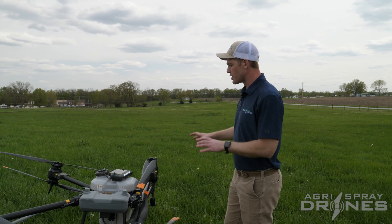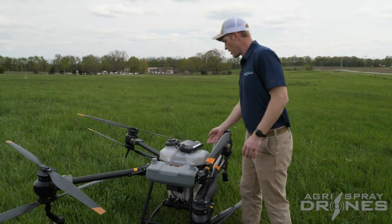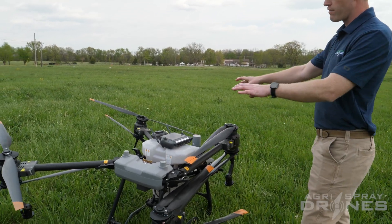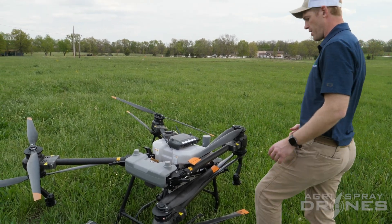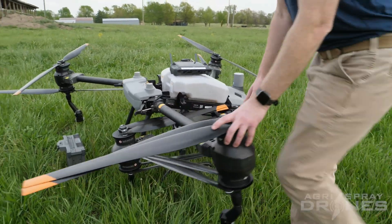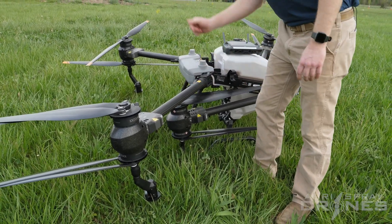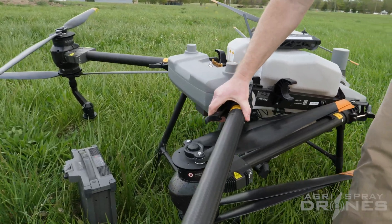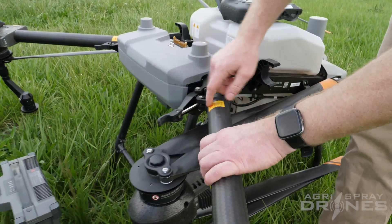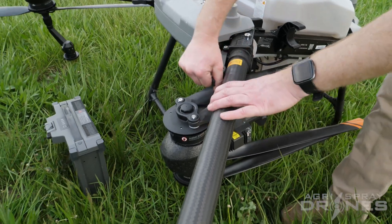Next, get a full battery for the drone — make sure you have a few of them, because you want to do a lot of practicing. Also make sure you have battery for your remote. We're going to fold the drone out. The side with the nozzle gets folded out first — fold your blades back a little bit, then clamp in the cam lock. You should hear a snap. If it doesn't pop in, you'll need to tighten the turnbuckle, then try again until you hear that pop and it's nice and tight.